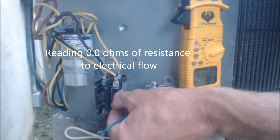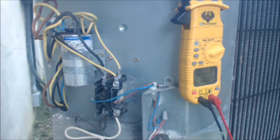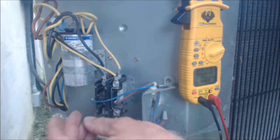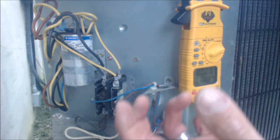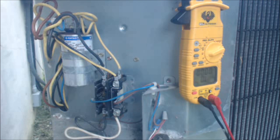We can go ahead and plug in our 24-volt wires again. Our problem with this is just that we don't have line voltage — we're missing our 240 volts coming in. But that's how it's done. So basically what you want to do is replace a contactor with the same amperage ratings — the same FLA, full load amps. Change out the same contactor for the same size contactor. It has to do with the amperage going across these contacts. If you put a smaller contactor in and this unit's a 5-ton with a compressor drawing more amps than a 2-ton would, you'd need a larger contactor. You can get them in 20, 25, 30, 40, 60 FLA. Get a couple different sizes for your service truck. Hope you enjoyed yourself — see you next time at AC Service Tech Channel.